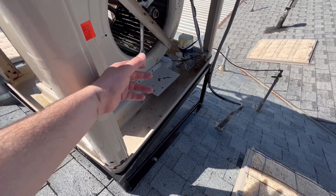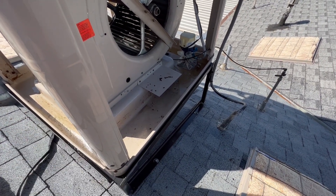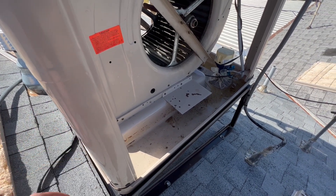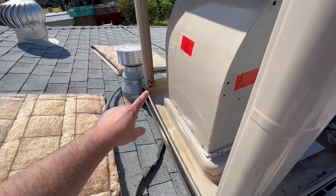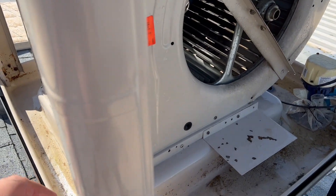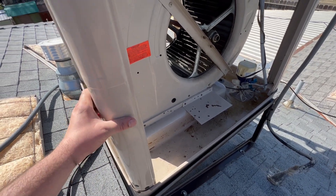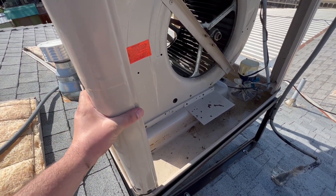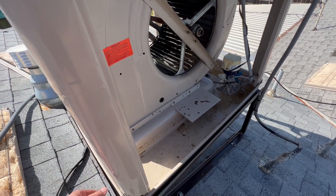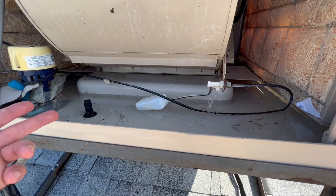Just remember — if it's rusted, you may need to replace the entire cooler because you'll be losing a lot of water. A typical swamp cooler will last maybe about eight years. You'll start getting rust after a couple of years, especially because the bolts are just zinc-plated, not stainless, and the paint jobs are mediocre. Expect about five to eight years before you need to patch it or replace it.